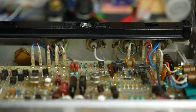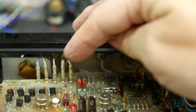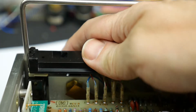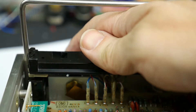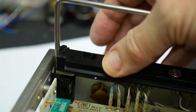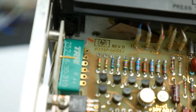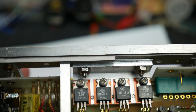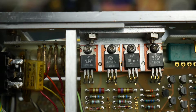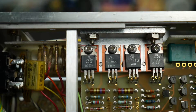That's the back of the front panel with all the little wire connections going to the front panel. That mechanical thing there is the back of the geared-down frequency knob — when you turn it, it's pressed against the back of the dial by that spring. Another HP logo there, all in gold plating. They've got some more power transistors — these may be the power transistors for the power supply regulator. I'd have to check the schematic. TIP 42, whatever that is — a little Texas Instruments part.